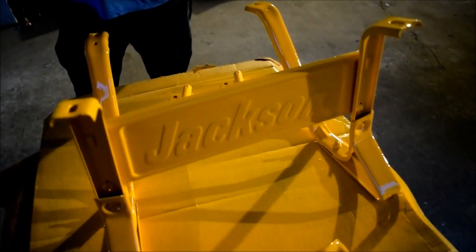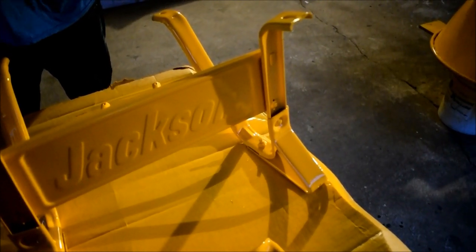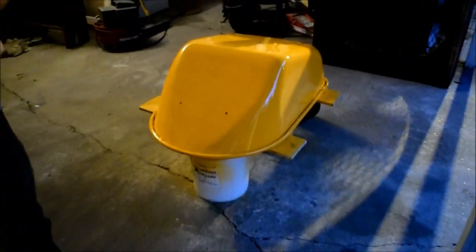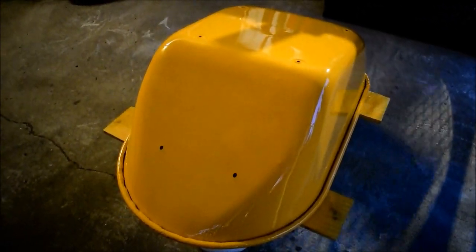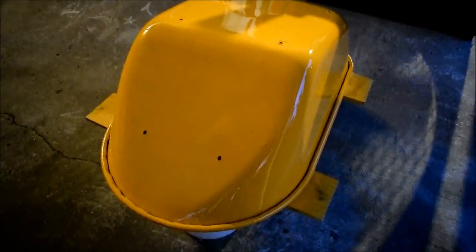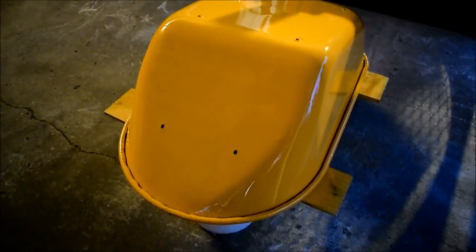We'll wipe the urethane down and paint them, especially after we drill the holes in them, because that's where they rot, where the holes are drilled. Oh yeah. We pre-drill the holes and then soak the inside of the holes with extra thin IH white implement paint, and white the whole handle. So we paint the entire wooden handle white, even the grip where you grab it. That's a good idea. That'll seal it in. Well, especially where we drill it. It'll stop the weather from withering it away.